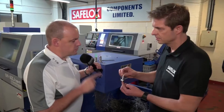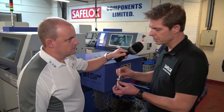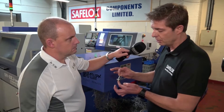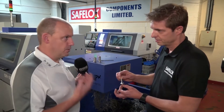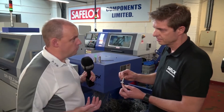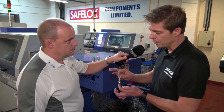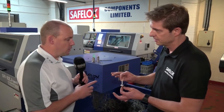So why do you think the machine is able to produce such a better surface finish? It's a number of reasons really. One is mineral oil helps a lot. Also the rigidity of the tooling and the slide — these are dovetail slides in this type of machine and it does seem to give you a vibration trouble-free finish. In terms of production speed, there's definitely a cycle time improvement — probably by half — but what's more significant is the fact you're no longer unloading it by hand; it's fully automated.